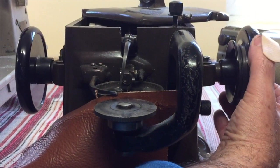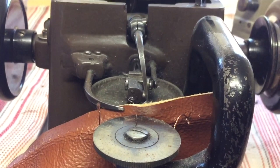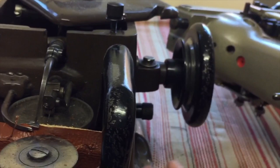If I push this up too high, I can get this looper to hit the leather — look at that. On sheepskin you need it high, because you don't want to stitch right on the edge or you'll tear it. So if you have a CCS or SF model, you can't have that low lift — you need a different machine. Leather you can get away with a low lift, and this is the lowest. Here is just a guide so the leather runs against it.